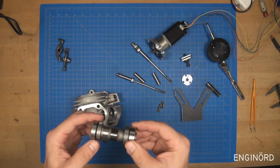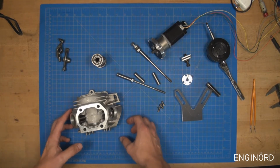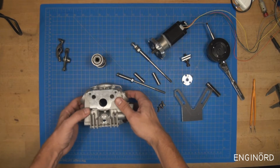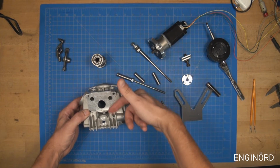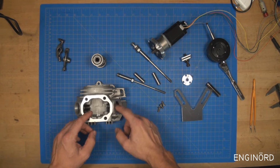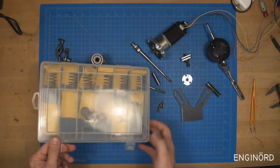The problem with the scan was that there are a bunch of other parts in the assembly and everything has tolerances. So first of all, here is the cylinder head. You know, there are positions of these holes relative to the combustion chamber, relative to the valves. There's a length to the valves. Also, the valves have a lock system, probably familiar with.